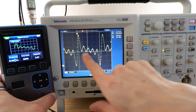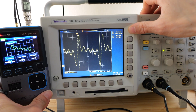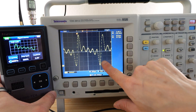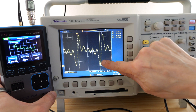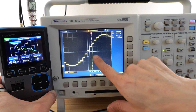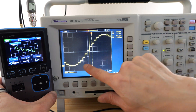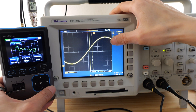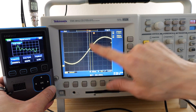Here it is set at 1 kilohertz. However, I'm measuring a period of 872 microseconds — it's a little bit faster than what it says. I also notice a little bit of artifact on these little steps here because it's generating that waveform. Let's zoom in to look at what's going on. Here we see it changes the voltage every 10 microseconds. There's a little step there — a bit of DAC conversion artifact. Interestingly, when I changed it to 50 kilohertz, you do not see the artifact as much.